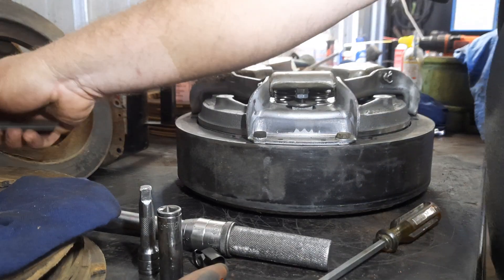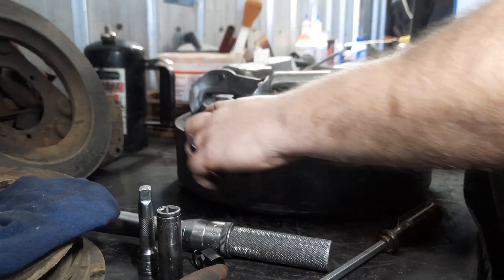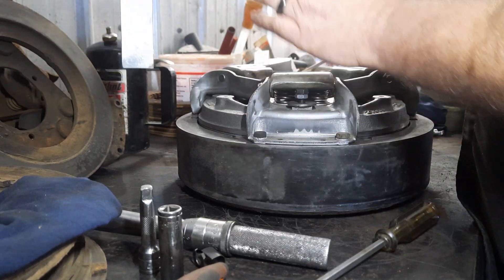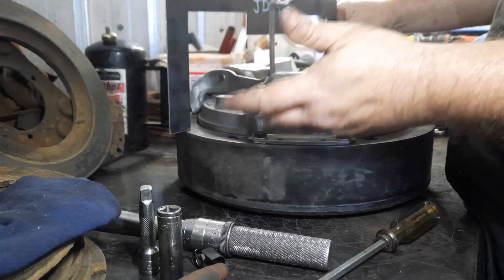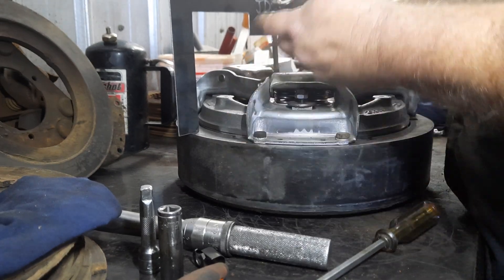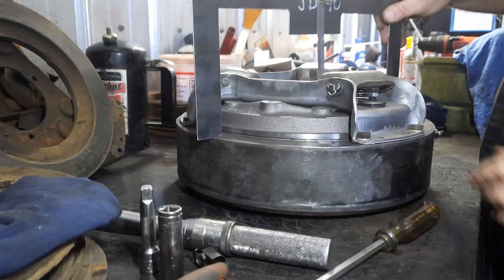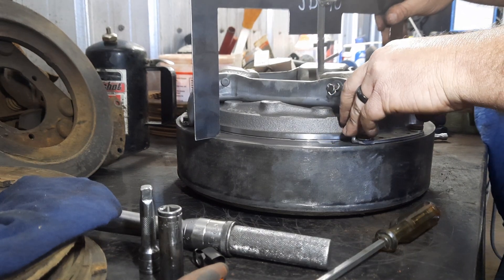The book says you're supposed to use a tool similar to this — I believe it's a John Deere 264 — but I don't have that. What I do have is the measurement: from here to the clutch finger is 2.062 inches. So I've taken my dial caliper and my sliding T scale, measured it up, and it's pretty close. It's an old bulldozer, it'll be fine. If you prefer to do it the proper way, you can get the $35 to $50 tool that's made for this.